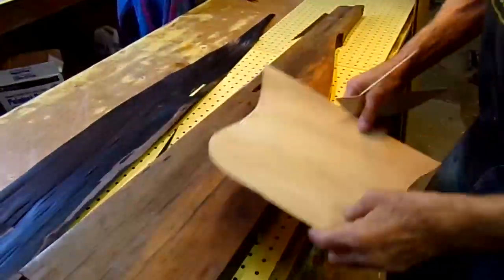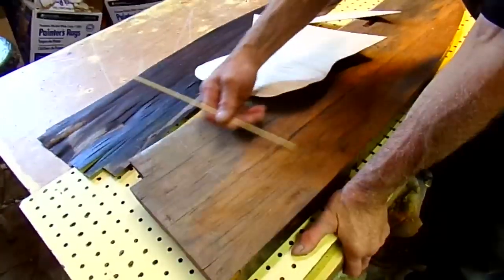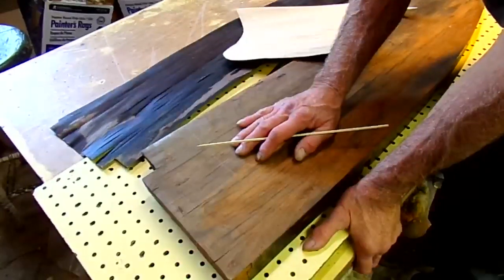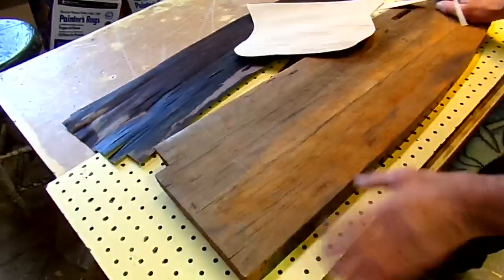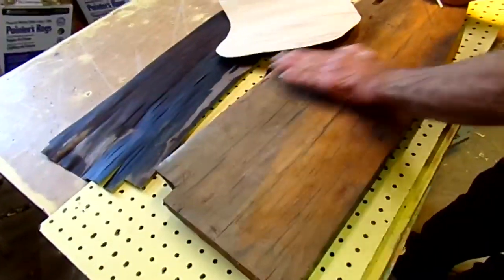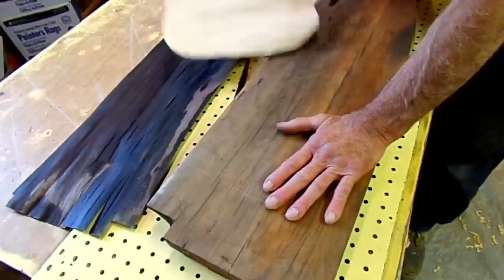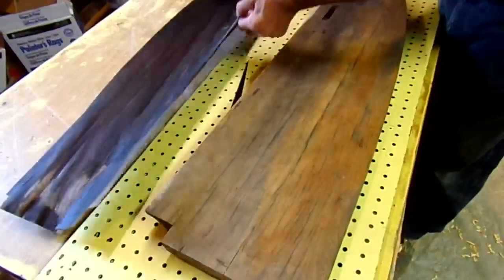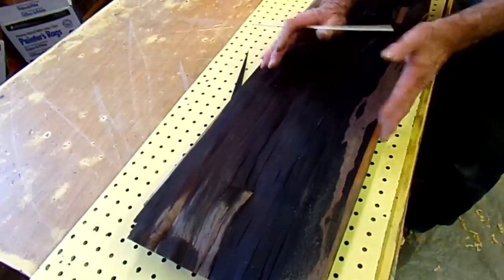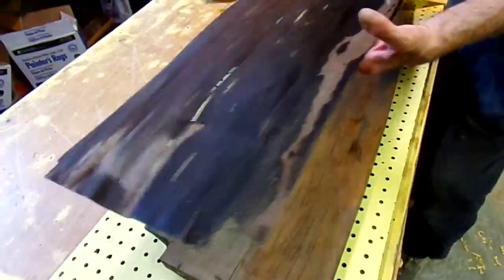A piece of cross veneer like so. Not this veneer, this is just an example. We have some real antique poplar underlayment that they used before they put the finished veneers on. And the soft underlayment, or the cross banding they called it, held everything together and also enabled them to smoothen it out very smooth before they put the finished veneer on. So that's what we're going to do. And that should stop this movement back and forth, season to season. It's going to split all our finish and everything when we put it back there. So that's what we're going to do.